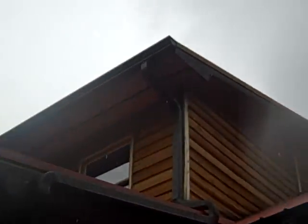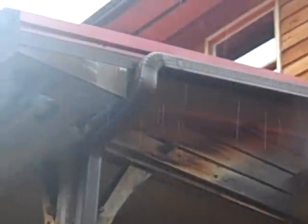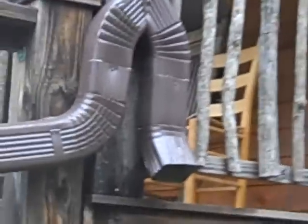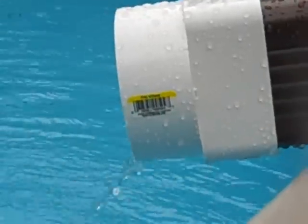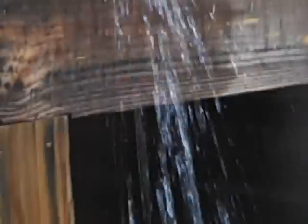I've got a 24 by 24 section of metal roof at the top of my house, and a gutter coming down with a regular A-elbow that swings down, kicks to a B, wraps around the fascia, snakes down to a diverter. It's a manual diverter — I'm eventually going to run it into a rain barrel, but right now I'm running the water out into my swimming pool, keeping it nice and full.